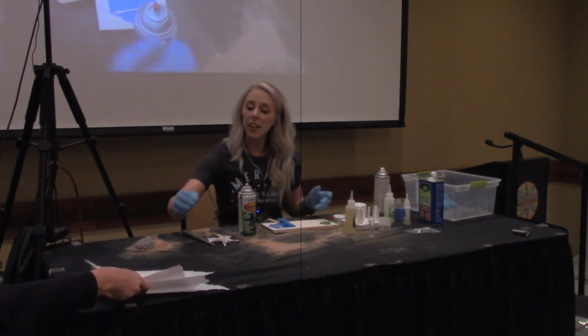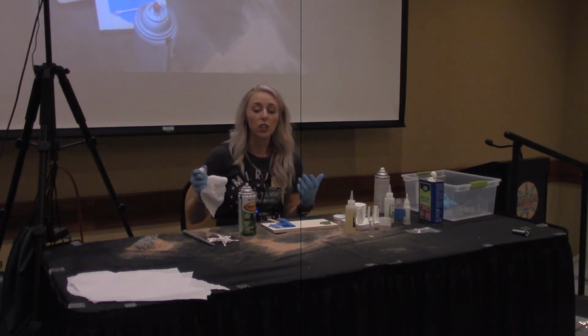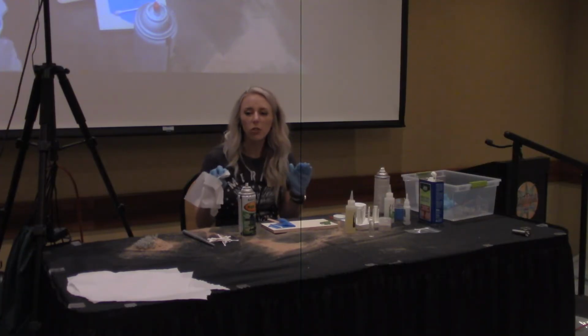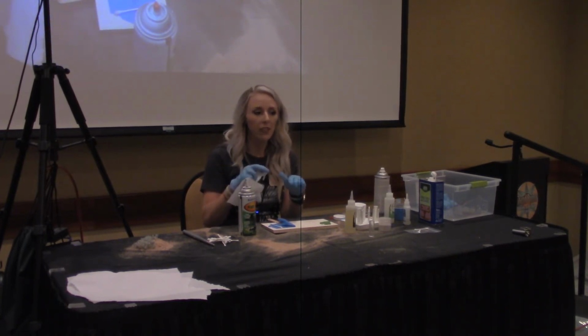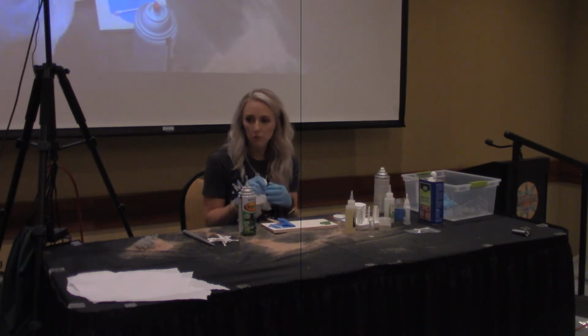Yes, so thank you. For the threads on that, I've tried painting it, and as soon as you screw it in, it just scrapes off. So what I do is I take the compressor, blow out the sawdust, and then the DNA, and then the CA. And that way it's completely crystal clear, and then it looks intentional when you see it through the blank. Because if it's muddled at all, it looks like an afterthought, and you're like, oh crap, it's not supposed to show. But when you really take the time and clean it out nicely, it looks intentional. And I've never had anybody ask, why is it showing? You know what I mean?